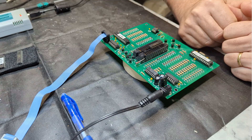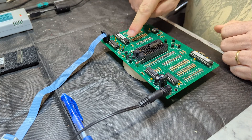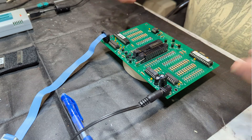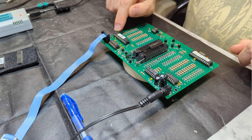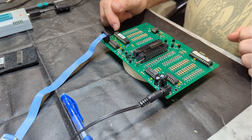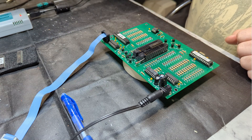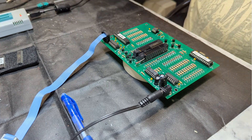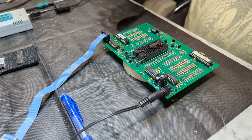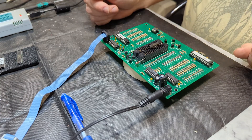That's the process of upgrading the chip tester. If you have to update the slave chip — we didn't have to in this case — it's exactly the same process: load up the slave hex file in the programmer, put the slave chip in, program it, then take it out and replace it just like we did for the master. It's that simple.